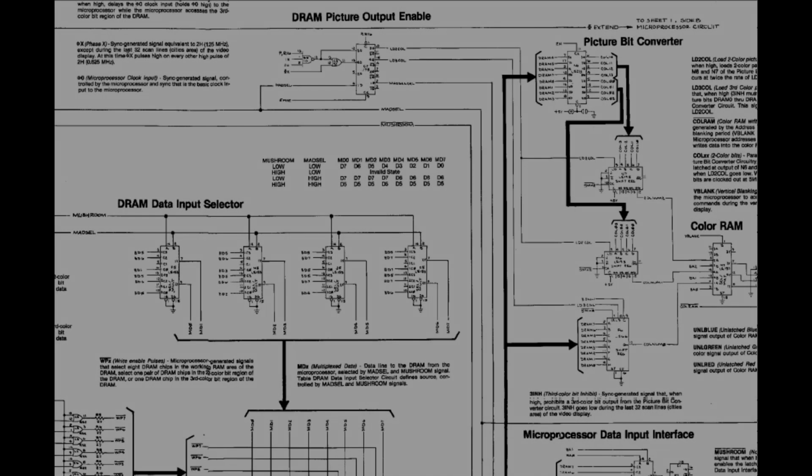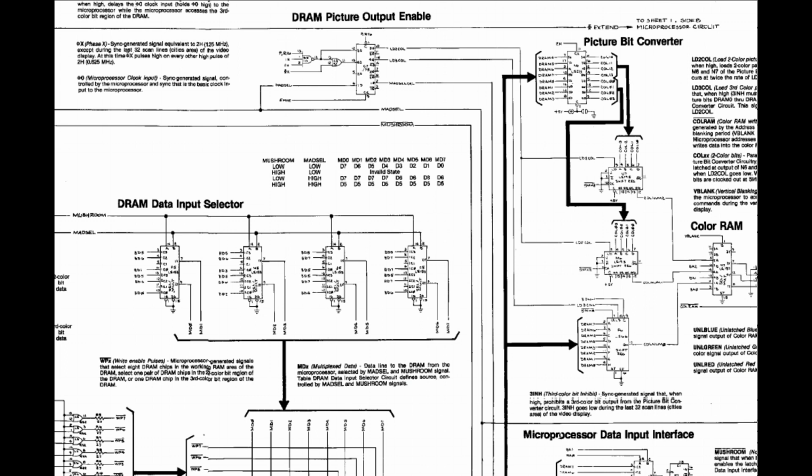Having designed the dynamic RAM comparator myself, I know very well what conditions must be true for it to give meaningful indications. Both these conditions were true when I successfully found the bad dynamic RAM ICs on the Commodore PET repairs.